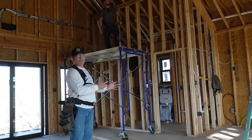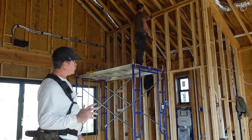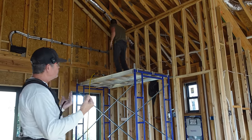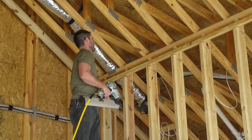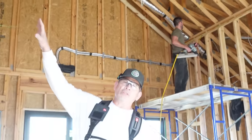We got this wall all padded out and it was super easy. We just picked up some 14 foot 2x4s, ripped them in half, and then put them on there so the inch and a half dimension was always the same. Padding it out an inch and a half towards me is exactly what we needed. As you can see, Rad's up there dialing in the ledger strip, the top of our padded out wall for the LED, so we match the detail on this side of the wall.